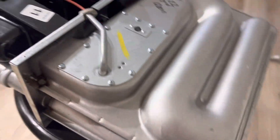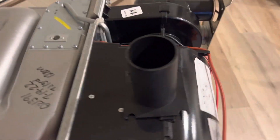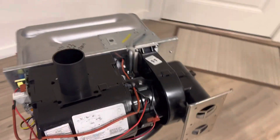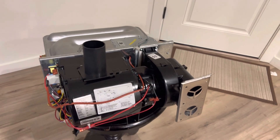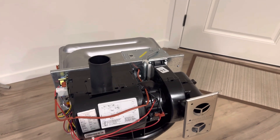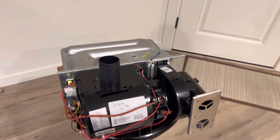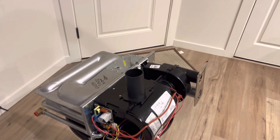There's also a sail switch and an off switch. You just remove your old unit, slide your new one in, wire it up, hook it up to the propane, do a leak test to make sure you have no leaks, and then run it for about 30 minutes to get rid of any smell it produces on the first run.